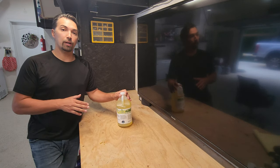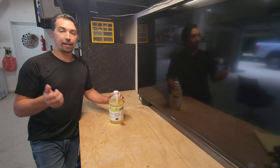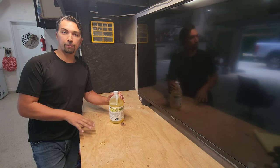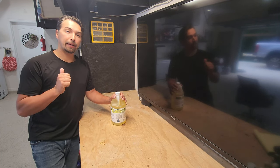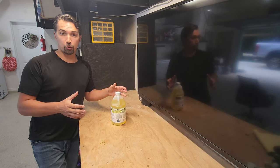We're talking about the Eliminator product, and I use this every time that I pressure wash a driveway. I have a four-gallon backpack sprayer that I mix my pre- and post-treatment chemicals in, and basically I'm mixing water, chlorine, and Eliminator in the backpack sprayer so that I can soak the area I am going to be pressure washing.